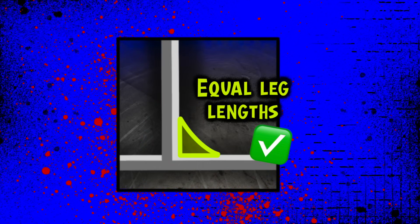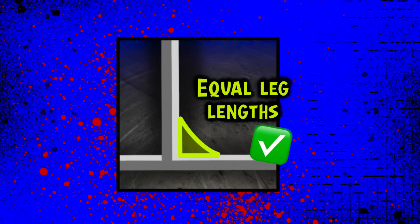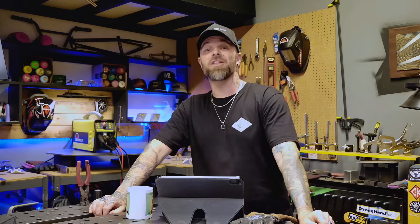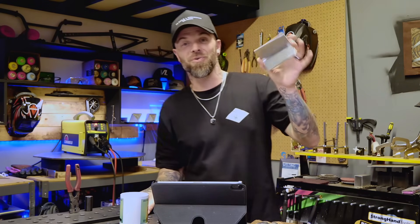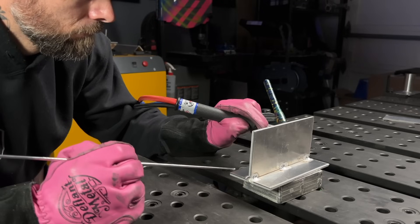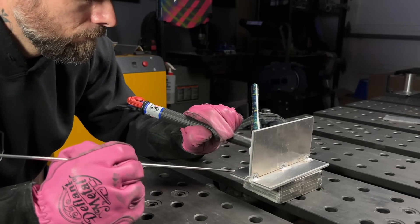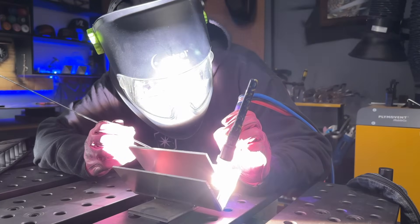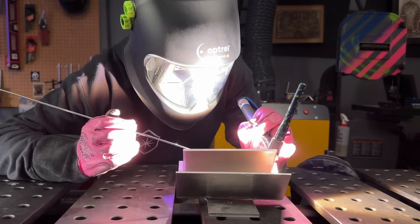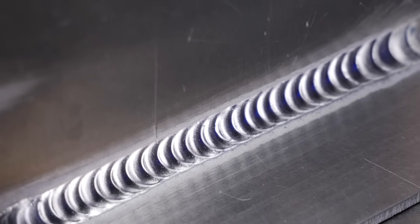Something like this example is exactly what you want — the welding profile is perfectly centered with even toes from top and bottom. If you are practicing the right exercises when learning, this is actually easier than you think. I recommend that when people learn to weld a fillet joint, they don't learn it in a 90-degree position. They learn it in a 45-degree position. You can see I have it positioned in a fixture holding the joint at 45 degrees. Working and learning a fillet joint at 45 degrees helps you properly center the profile much easier and gives you much better vision to see way more clearly.